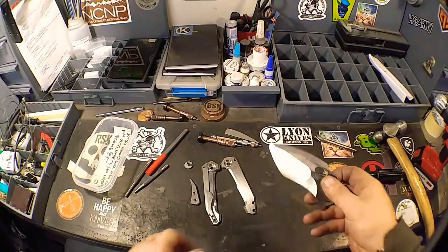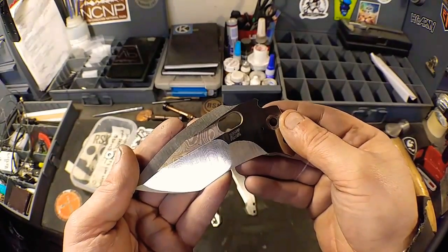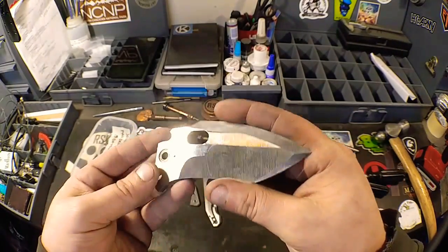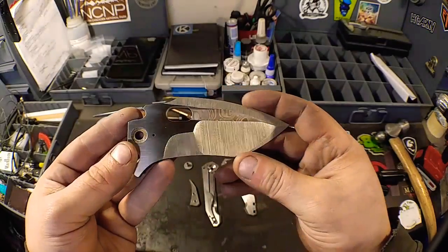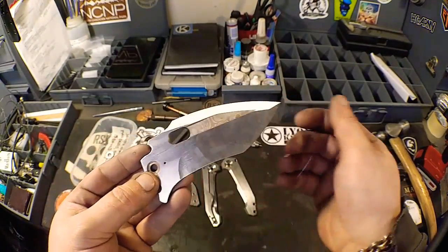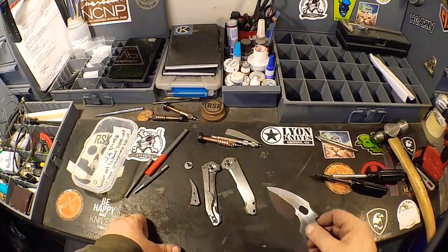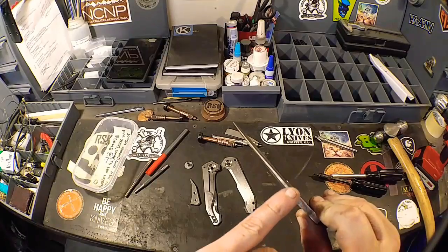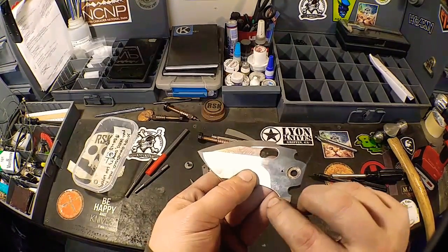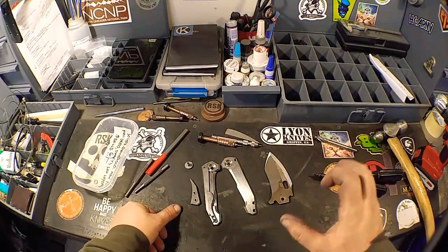Everybody, all right, so I wanted to go ahead and stop here for the day. We've got our blade done up to a 120, so tomorrow we're going to pick up and start right off at the grinder and bring this blade the rest of the way up through the grits, man, all the way up through that 400 Trizac, and then this is pretty much ready for an etch, man. I've got to just go around, do all of my profile, put in my sharpening notch, and then just chamfer off all my rough edges after that.